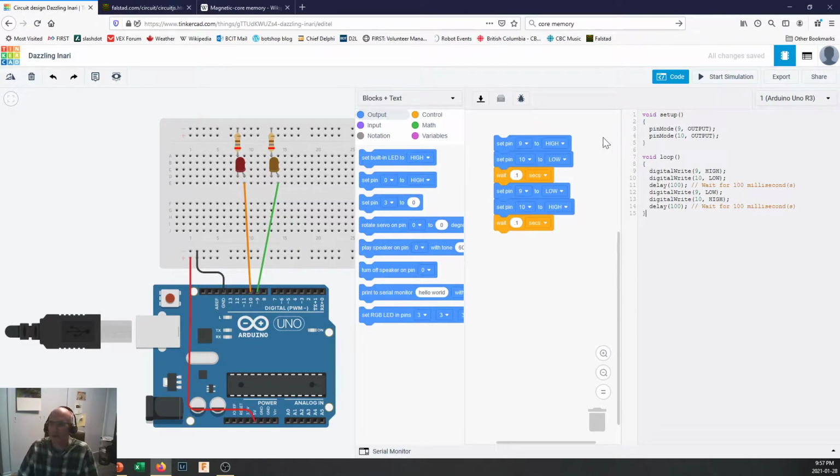You could come down here and you could run your circle routine and go back to void loop. That's fine. You could call it from your setup routine and come down here and run it and come back here and then go into your void loop. And loop, as the name suggests, is what's going to run forever and ever, or at least until the Arduino loses power. So setup, this code runs once. Loop, this code runs until you turn the Arduino off. It just keeps going over and over and over, as the name loop would suggest.